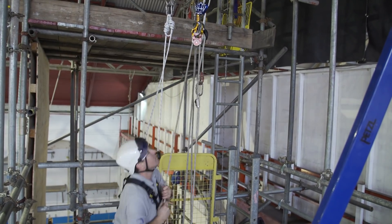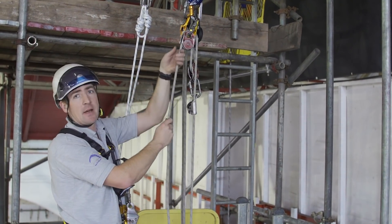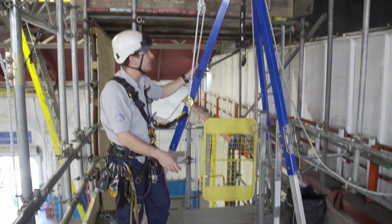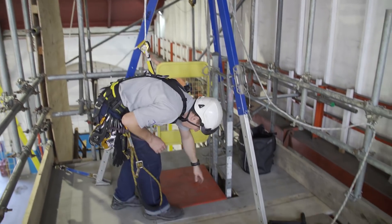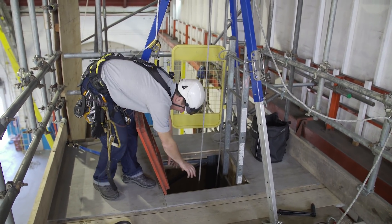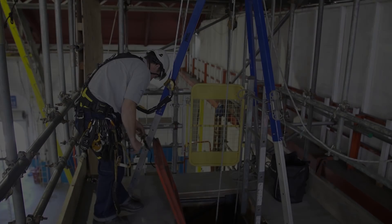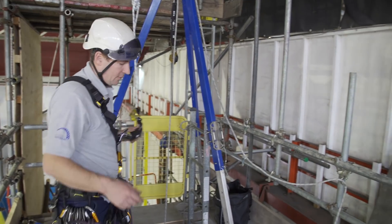The new rig is great because we don't have to start messing about with that. If we're not lucky enough to have a head rig or something like that above our confined space entrance, then we could look at using a tripod. It is important that you use something rather than just trying to pull your casualty up to the edge, because if your ropes are running over the edge and you try to get your casualty out it will be very difficult. So tether the hatch and then we're going to look at a few different methods.